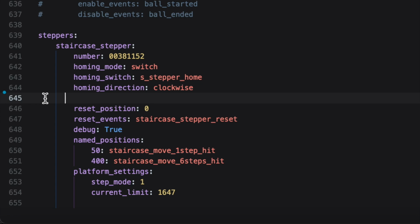What happened? Well, if you go through the Tic Control Center, if you remember, and you're playing with the values there, you can set what that maximum current limit is and the step mode. If you want to be doing full steps, half steps, quarter steps, eighths of a step, etc. And depending on the control board you have is just how fine of control and how many micro steps you're able to handle. Well, those settings will get saved to the board. They get flashed onto the board itself to be used.